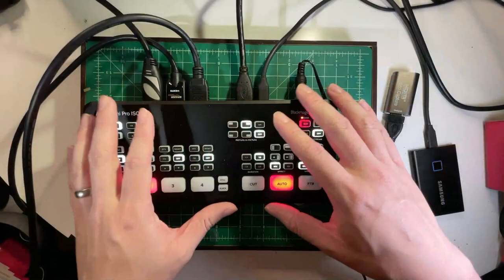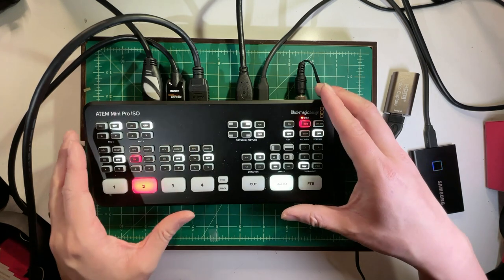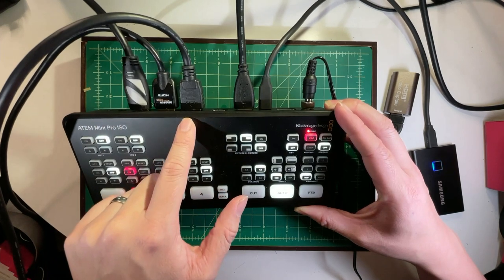All these devices have HDMI out. With dedicated professional cameras like DSLRs or video production cameras, the HDMI out is clean and you can also record locally while you have the output active. So I record locally on my DSLR, locally on the FS5, and of course locally on the iPhone. The iPhone can have some dropped frames when running a processor-intensive app alongside HDMI out, but all in all what we've been doing with the switcher has been pretty clean — a clean image without latency or dropped frames.